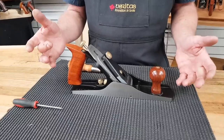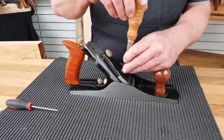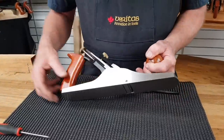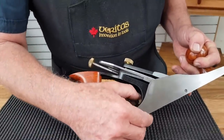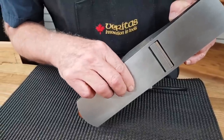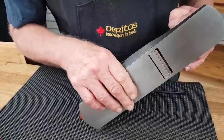One of the nice features is you don't even have to remove your cap iron. There are two points — a screw in the middle and one at the back that you loosen off. From there you can adjust that needle knob with right-hand rotation forward or back, and you can actually see the frog moving forward to reduce that opening, or open it right up for quite large shavings.